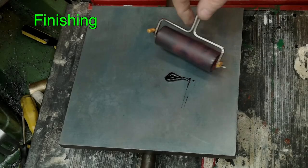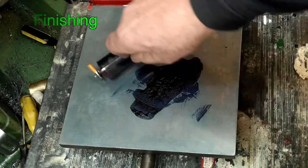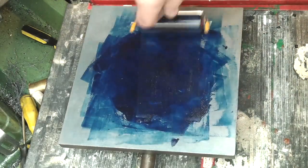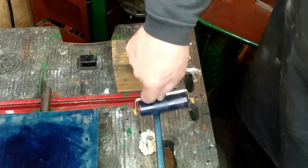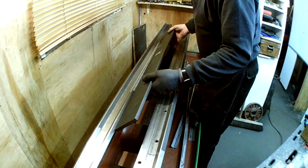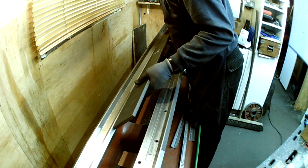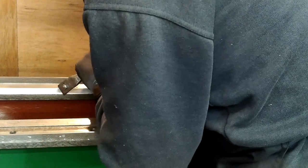Now that I've got the built-up slide somewhere near straight, I finished off by using the straight edge to get the high spots down to the same height as the least worn or unused parts of the main slide. I started with scraping the tailstock slide first because this slide was the least affected and in theory should be the simplest one to get finished.